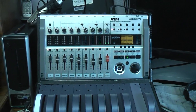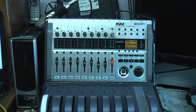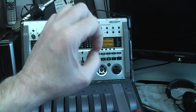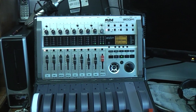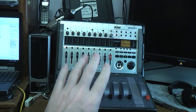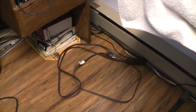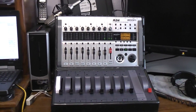So one of the first things I plan to do on this setup is hardwire the power adapter in place of that jack, so there's nothing to be unplugged. Coming out of the whole wood console that everything's mounted in I'll just have a regular grounded extension cord — and the reason I'm going with a grounded extension cord even though the adapters for the Zooms are ungrounded is because that's the next big problem.